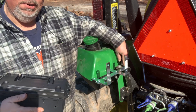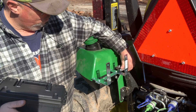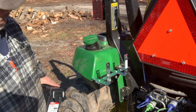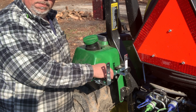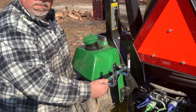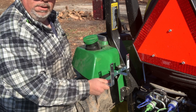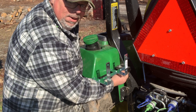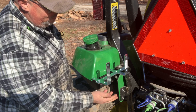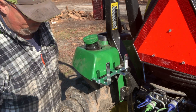So what I did on the 2032R — right here there's a metal bracket and it's got an open hole spot, so I just screwed that on there with a nut. Now it might need something different, and if you don't mind drilling through a piece of metal, get yourself a thicker base plate. It is swiveling a little bit — maybe I needed a locking nut or a washer back here. That's the only drawback so far — it turns because it's only got one point back here to tie it down.